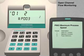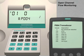Press the Up Arrow key to go to parameter number 4. Parameter 4 optimizes the Multiranger for the specified transducer input. The input can be either a transducer or a milliamp input source. In our application, we are going to use an Echomax XRS5 transducer. The XRS5 transducer has a numeric value of 112. Enter 112 followed by the Enter key to set parameter number 4 to this value.